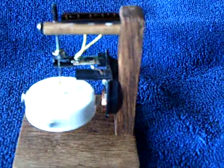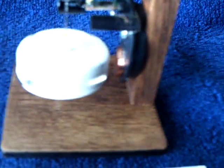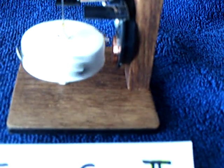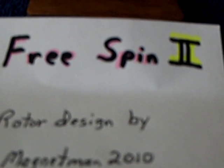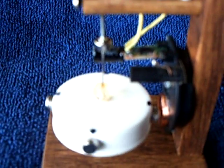I am using a rotor that was really designed by Magnet Man, and I've modified it slightly — I'm going to be putting my name on it too, because this is a jar lid, which is my 'lid motor.' His design on how to make this was absolutely brilliant. I recommend you go to his channel, MagnetMan2010, and look at how he made this stable. It's a needle with a magnet down there that it sits on, and a magnet up here that attracts the top of the needle. The rotor has four magnets, and he found out you have to be careful if you overspin it — the magnets will throw — so he puts tape around them.